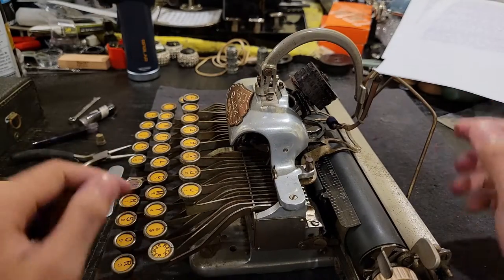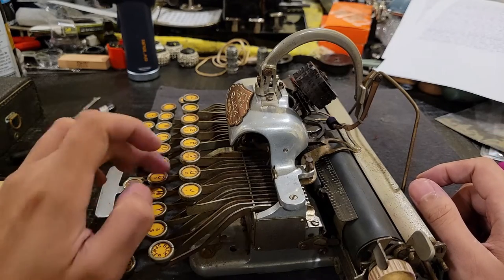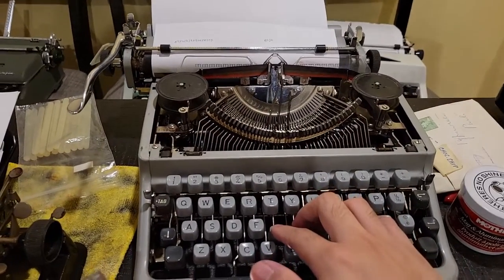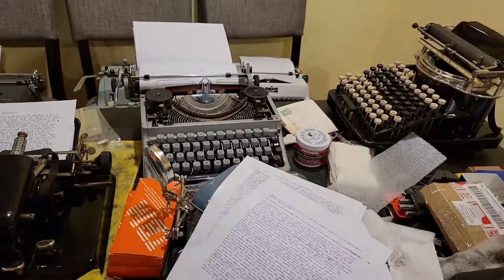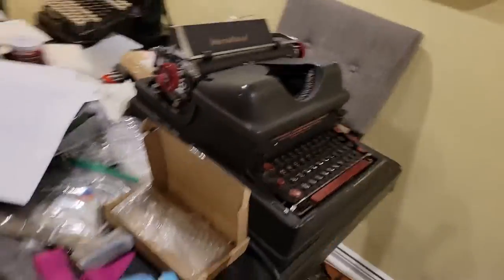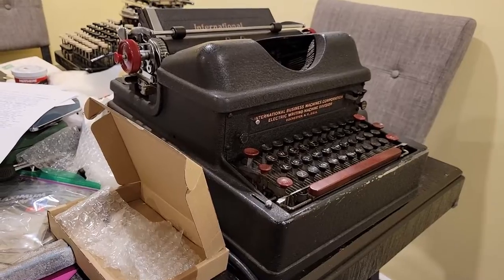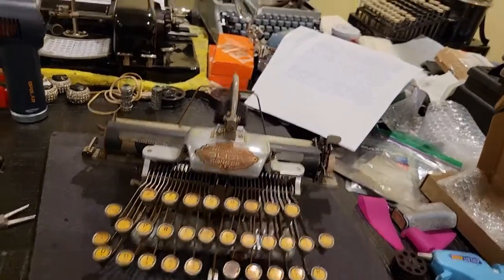So that allows this machine to be used as fast as possible for its particular mechanism, though in this case, unfortunately, due to the fact that to reliably index a character, you have to completely release a key, unlike on typebar typewriters, where it is possible to have more than one typebar in flight at a time without them colliding and jamming. So that allows these machines to be used at the fastest with, say, at least from what I found, I think, Stella Pajunas from 1946, her record was like 216 WPM, or an average of 18 characters per second, which is quite darn fast, compared to 5 to 6 on this machine, or 4 to 5 on this machine.